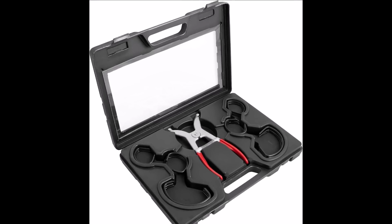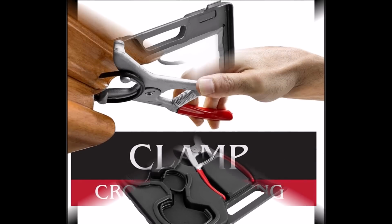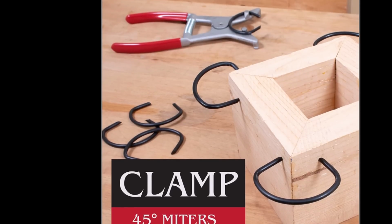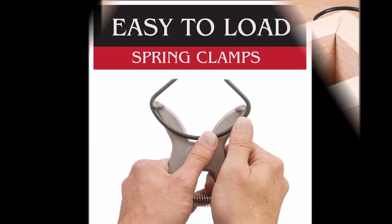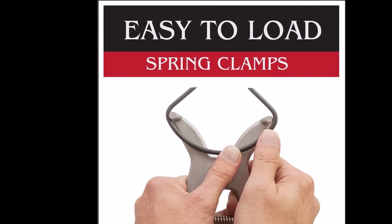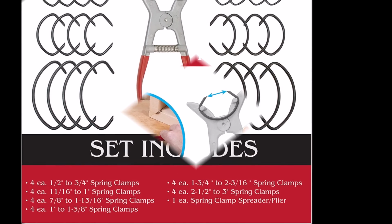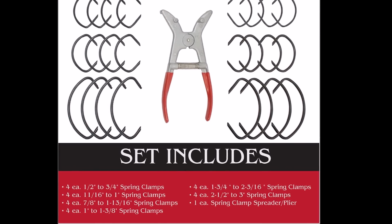These spring clamps are the ideal and cost-effective way to quickly and easily clamp mitered corners without all of the hassle you typically have with other clamps. The spring miter clamps are made from a high-strength steel. The clamps can be applied using the easy-to-load, spring-tensioned pliers to make it super easy to spread the tips apart. Once you have the clamp tips spread apart, simply place the spring clamp onto the mitered corner you need to secure, then release the clamp so the tips pierce into the wood and keep your stock in place.